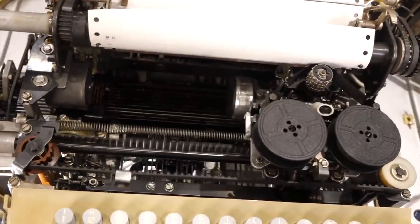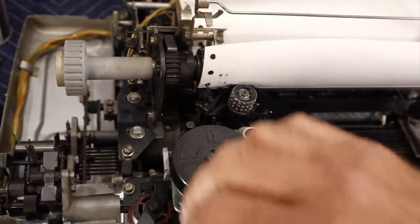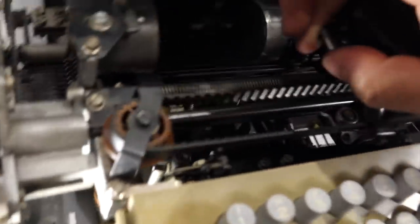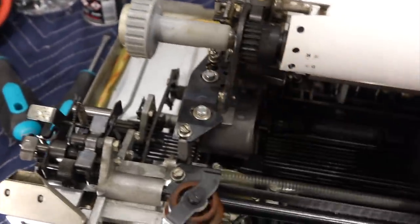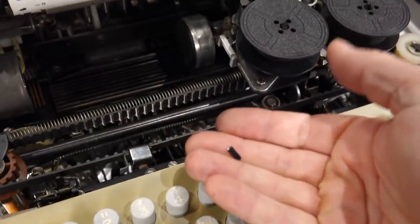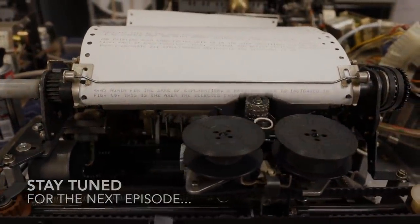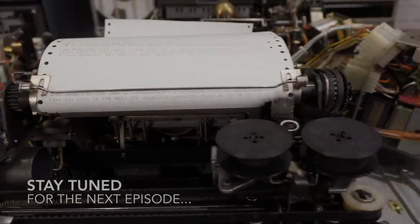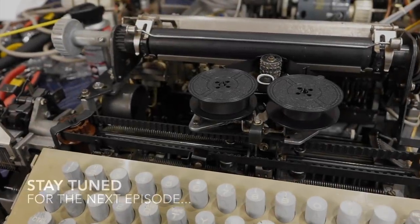I was just about to make a demo, and now this happened — the carriage returns, but the ratchet doesn't reset. That's because there's a little tang down here that broke and pushes on the ratchet mechanism. There's a little protrusion, and that's what's left of it — it broke. So now I have to take the carriage out and replace the part; I have to make a new one basically. So I have an unreliable carriage return, but we're pretty darn close. I'll see you next time.